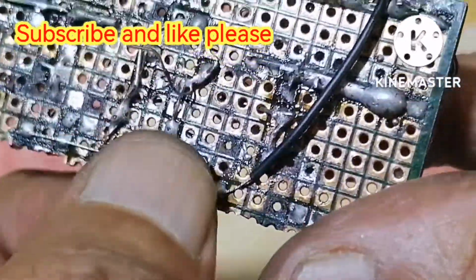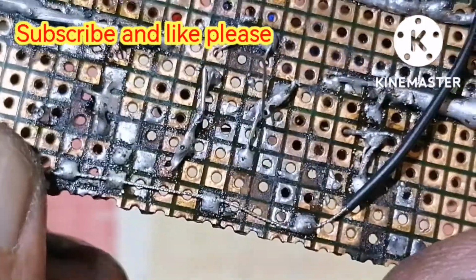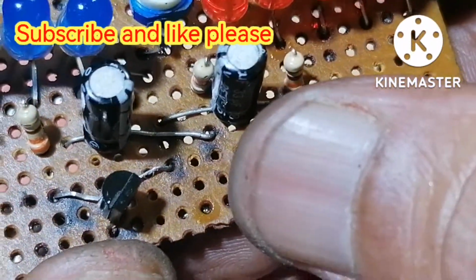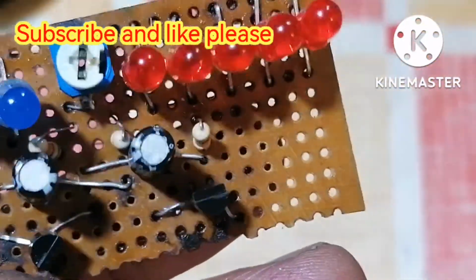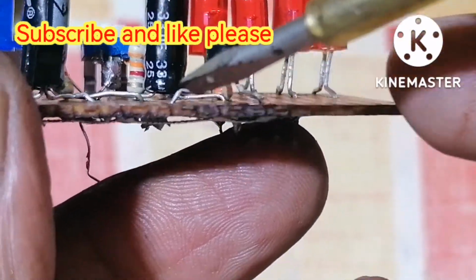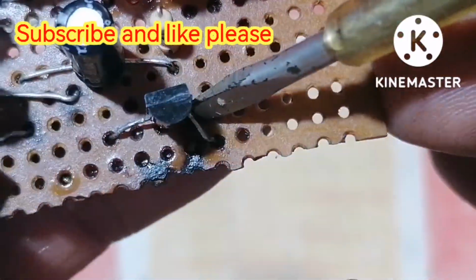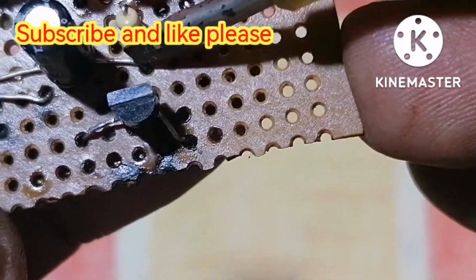Emitter goes all the way to negative over here. That's emitter, 1, 2. And base will go to 3.3k. Where's that one? Yeah, this is 3.3k. That's the base, 3.3k, and collector will go to 330, this one over here.